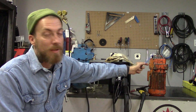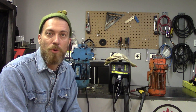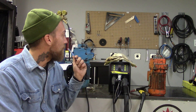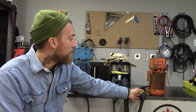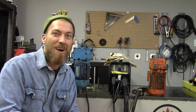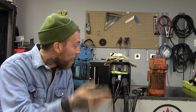The second mistake I made was welding these cold. I didn't realize they need to be preheated — in hindsight that makes a lot of sense. When we do these next week I'm going to bring in the oxy-acetylene torches and preheat these to at least about 200–250 degrees. If you don't have an oxy-acetylene setup, you can use a little propane torch, or using no filler just use your TIG torch to establish a puddle and walk it back and forth for a minute or two until it gets red hot. But I'm going to stick with the tried and true oxy-acetylene because it'll give me a nice even heat without going overboard — I don't want to ruin the little bearings in the top.